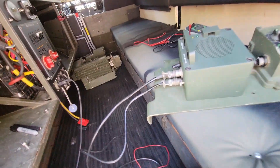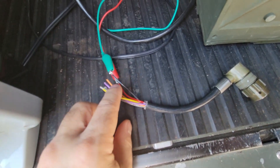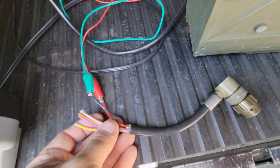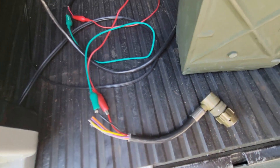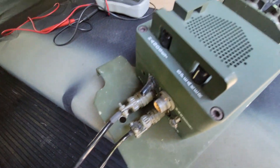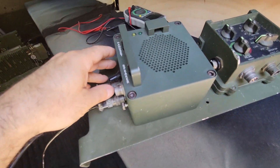So let's take a look at some cabling. This is a highway cable — I had a whole bunch of these and one was about three feet long, which is totally useless in most applications, so I decided to cut it off. I opened it up and figured out through some documentation that the output power from the VIC-3 on the highway comes from red and black — no surprise there. I've got a couple of alligator clips on this wire that goes all the way into the speaker, and I've got my 1702 for some squelch. So let's power everything up and see how it works.